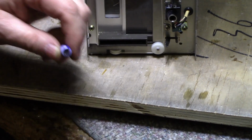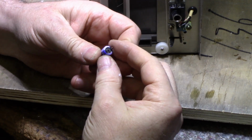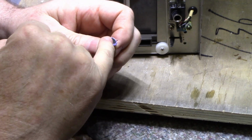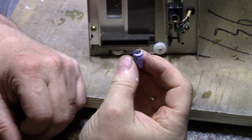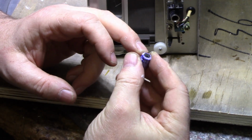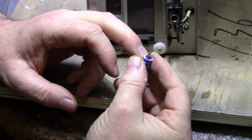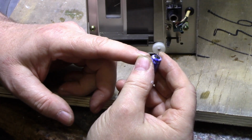Okay, just out of curiosity, I pulled the second cap out of the circuit, and yes, it has corrosion on the negative lead. So this cap is leaking. So it's looking like this receiver is going to get a full recap. I can't trust these old capacitors to continue working without taking a dump on the board and on the circuitry. They're all going to come out, like it or not.